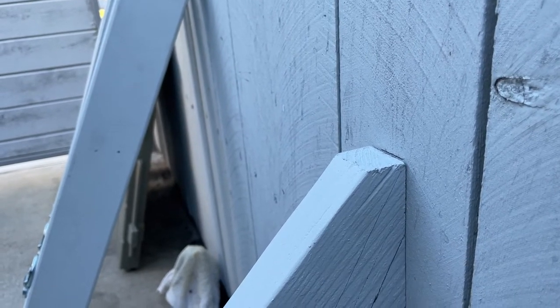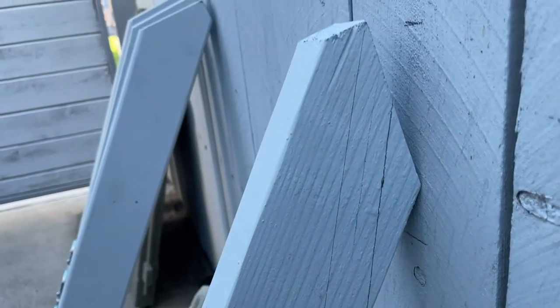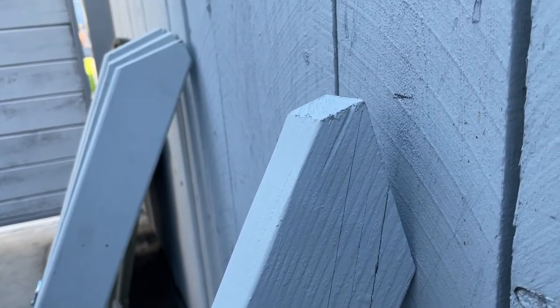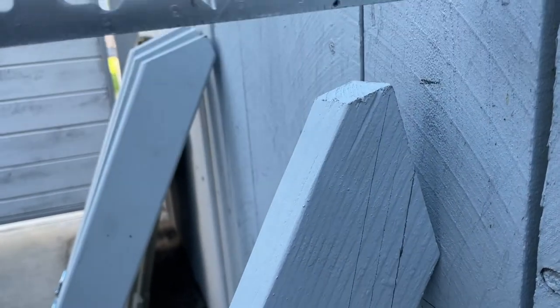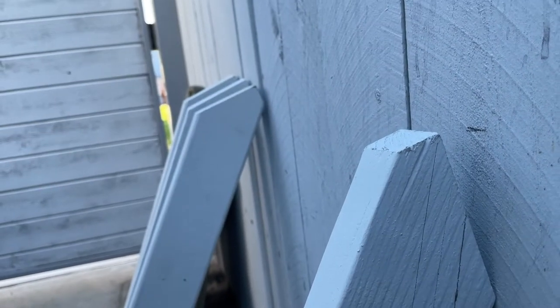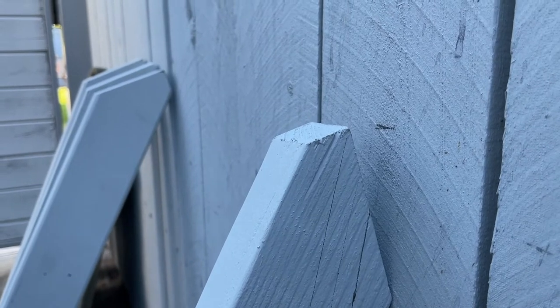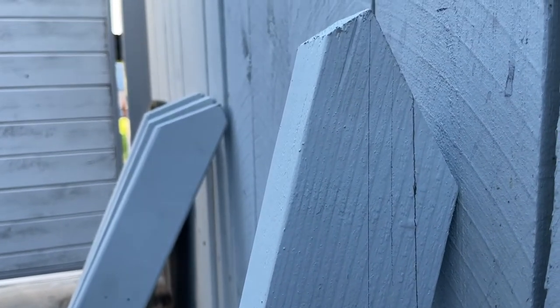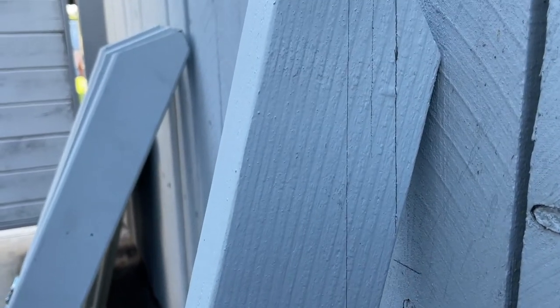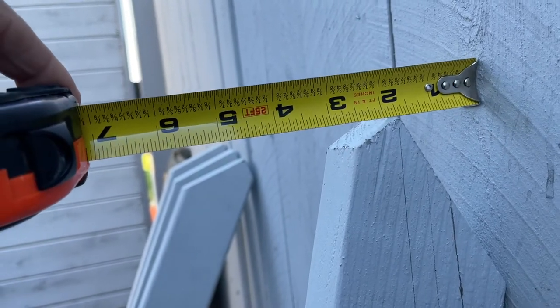And as this rotates up on that beam, that mark right there is 1 inch out. 1 inch out. And that's the top of that beam. So if I wanted to take that up to 8 inches in elevation difference, I'd go up to about here. From this line to this line here is 8 inches. But as you can see, that kicks the top out 2 inches. Pretty close to 2 inches out.